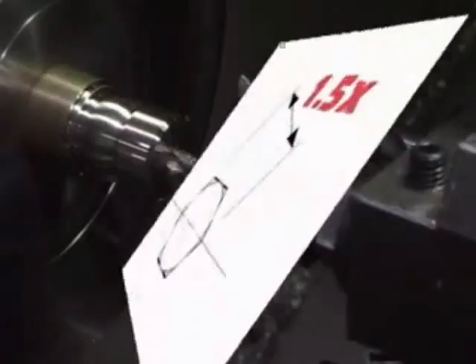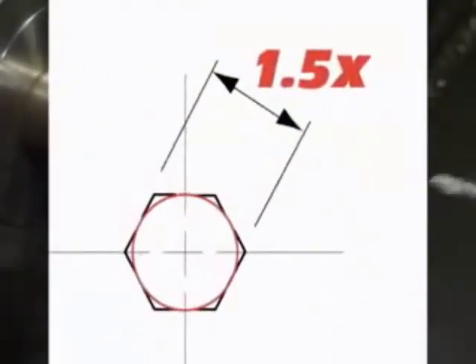Form sizes can be broached up to 2 inches in aluminum, and impressive hole depths are being successfully achieved every day. The practical forming length of rotary broaching is up to 1.5 times the distance across flats.